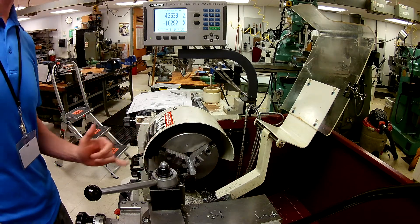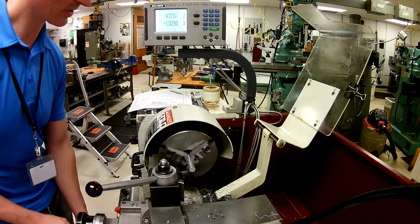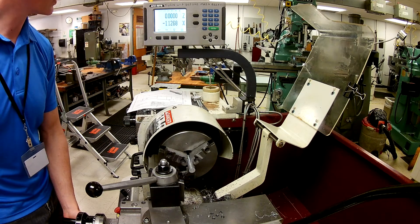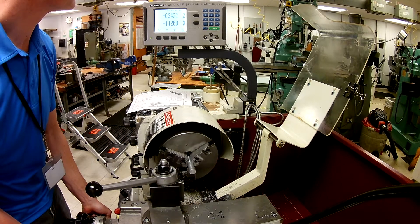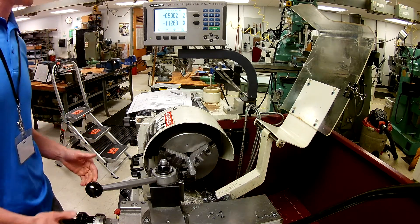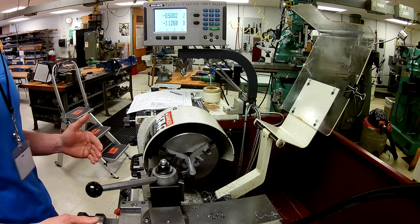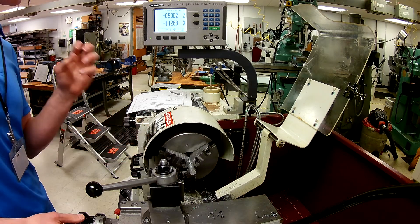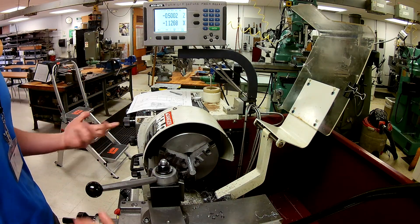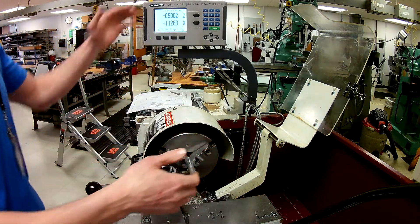We've already marked this, but if we really want to do it with accuracy, we can start by putting the compound up here, touch this off, Z is zero. Then we can go up here to a half inch. Now I know that this is exactly the half inch. So I can do it two ways: continue to cut on this path until I just meet that line, or run my cross slide up until I just touch the part, back it off since it's such a shallow angle, and make that feature. That's what we're going to do for simplicity's sake today. My tool nose is where it's supposed to be — I touched off on the end and went Z over to the half inch.